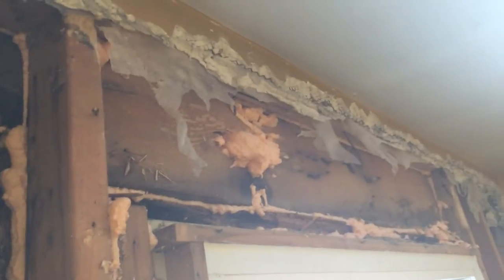Just look for any gaps and cracks. This window here is rotted out from ice dams, and this crack is really quite large — it's actually totally rotted out the sheathing. You can see right here this is the wood siding that went over top of that, so all of that needed to get hit. I foamed that whole area as well.